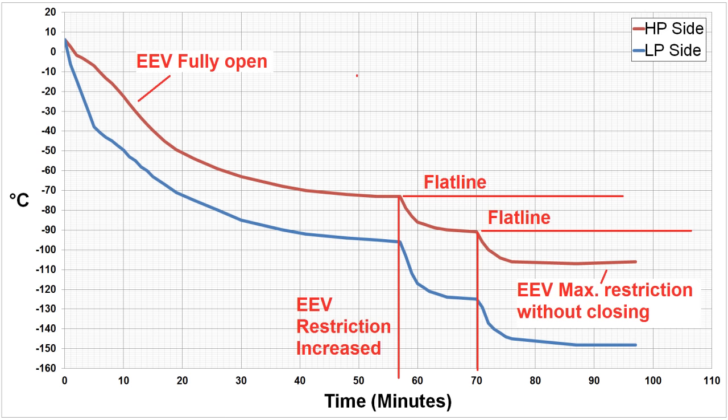In theory I should be able to continuously flow gas over the cold head to liquefy it, but there's a ton of tuning required to get the flow rate just right for optimal thermal loading on the cryocooler. Instead I'm going to redesign the cold head so that it has a relatively large reservoir for the feed gas in contact with the low-pressure return line coming out of the expansion valve. This way, pressurized gas can sit in contact with the cold return line as long as it needs to, cool and liquefy, then fall to the bottom of the reservoir. After 20 or 30 minutes I should have accumulated a decent amount of cryogenic liquid to discharge into my collection bottle. This is basically what I did in my video on cascade refrigeration where I successfully collected some liquid nitrous oxide at minus 88°C at one atmosphere.